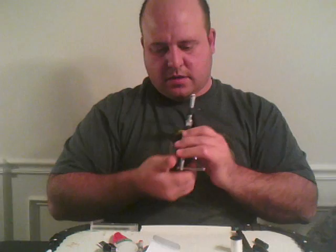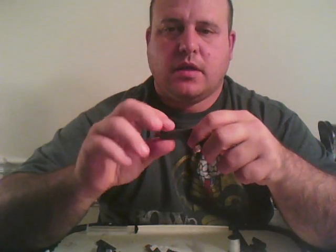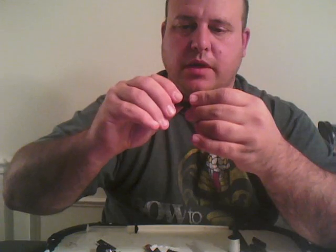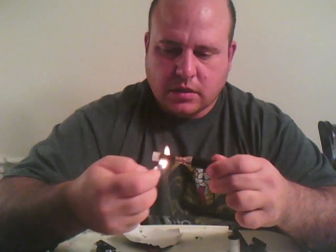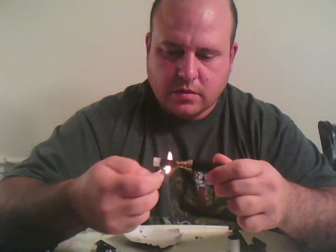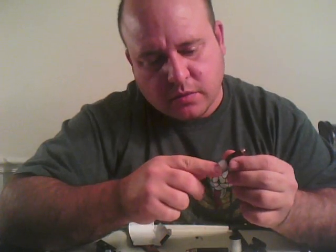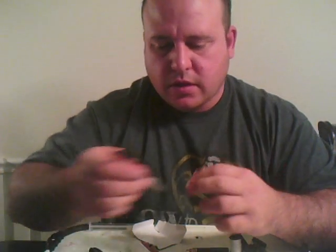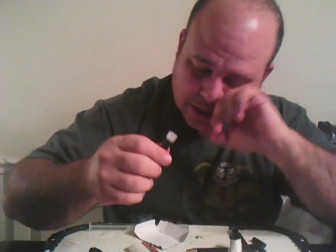Should be dry — go ahead and loosen up the clamp and pull it off. Next step is to take a piece of shrink wrap. The reason why I'm putting this shrink wrap on is because when I cut it, it's going to hold the seal in place. Shrink it on down like so. When you shrink the wrap down, you can see the outline of where the holes are — you want to cut out the holes. Cut out the hole, then just do the other side the same way.